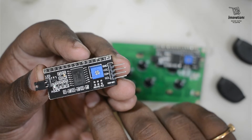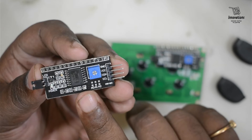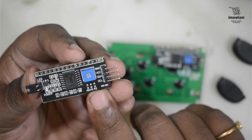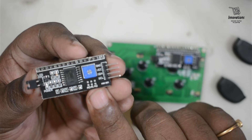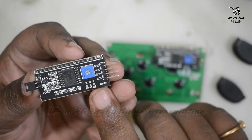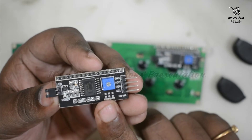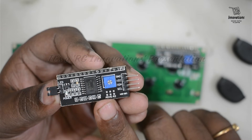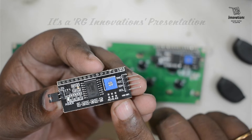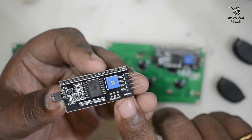Several companies including Texas Instruments and NXP Semiconductors manufacture the same PCF8574 chip, and the i2c address of your LCD depends on the chip manufacturer. There are three address inputs that can take two states, high or low, giving 2³ or eight different address combinations. All three address inputs are pulled high using onboard pull-up resistors. If your adapter has Texas Instruments' PCF8574, the default i2c address is 0x27. Shorting a jumper pulls an address input low; shorting all three gives 0x20, so the range spans 0x20 to 0x27.